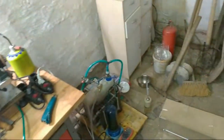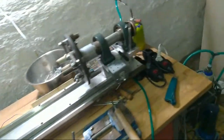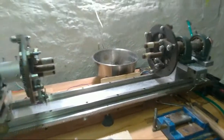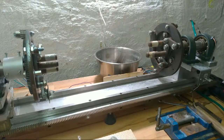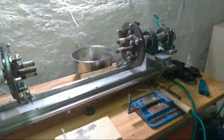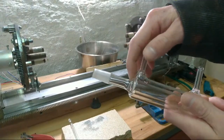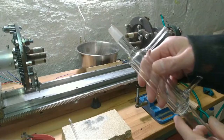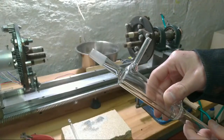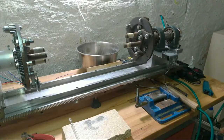And there's my HHO system. So I'm using that for flame, and also I'm mixing some propane in. So the temperature is a bit colder, at least I hope it is. Don't know, it works. Yeah, and here is my annealing oven. I had quite big trouble making these condensers because, let's say, I made this side, and then I moved there, and then I started heating this, because, I don't know, I guess I shouldn't do that. So this side actually cracked a lot, so that sucked.